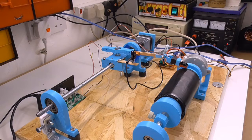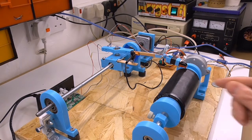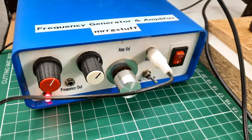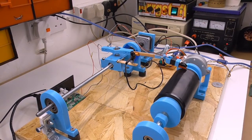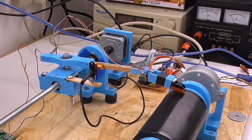I've got the PLA stylus in, as previously mentioned. I'm going to be running this test at 160 RPM. I've done a couple of runs through already, and to be honest it doesn't track very well — I either get echo, or there's a loud passage about here that it really isn't happy going past. So I think the larger ball shape of the stylus is not fitting in the grooves very well. I've got an amp — which will be what you hear to begin with — and then I'll cut to the actual audio track that I'm recording. I'll be right back.